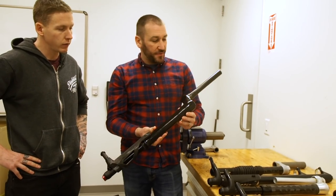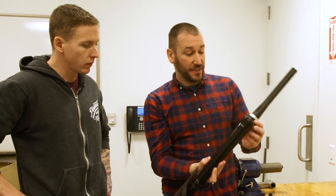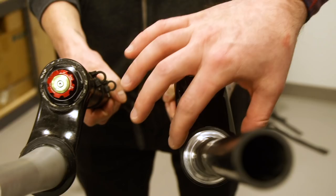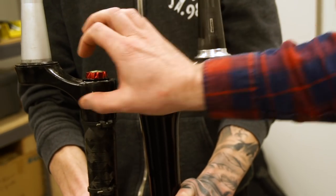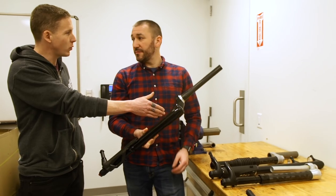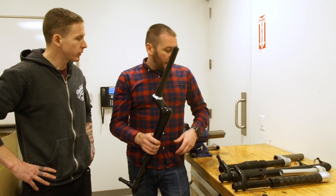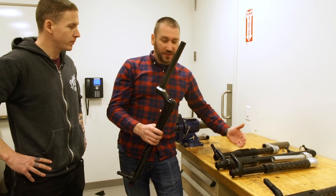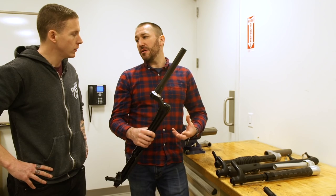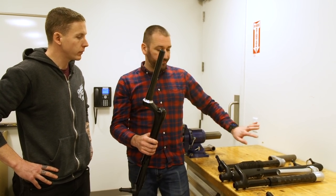The Lefty Ocho is the final product of all this development. We're a single crown now. If you compare the two, you can tell we really did beef up the crown significantly — deeper and thicker in every direction for the stiffness we need. Three-sided needle bearings. Starting in 1995, that's really the genesis of this project. This prototype still had the boot and the large 88 needle bearing packs, which didn't allow enough room internally — it was maxed out at 80 millimeters of travel, not enough for that time. So we pushed it aside.